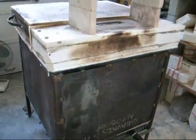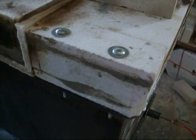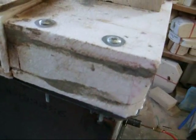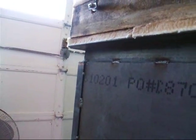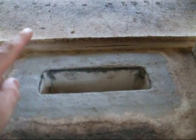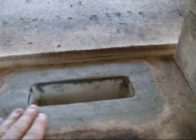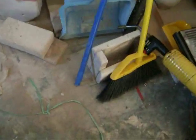Like I said, I had to construct this beam section that the chimney box is recessed into. After I set up this beam section I bolted it to the kiln — you can see the bolts here, top and bottom, bolted down on its lip. That's another reason why this piece of angle iron is welded like that, so everything can sit on top of it and bolt to it if need be. The chimney box section came up through here; after it was in position I cut it off with a hacksaw blade — the scrap is right here.